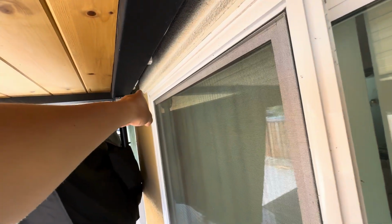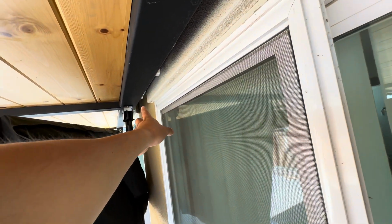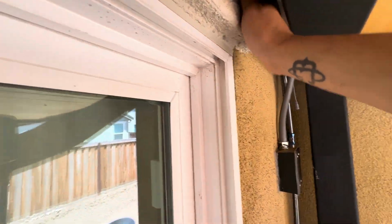So we're gonna go ahead and take it off again and do a 90 because it overlaps. So I'm just gonna do a back-to-back 90. Well, not really a back-to-back, it's just I'm gonna go to the very edge of the pipe, and whatever that gets me, it's a 5-inch 90. And after that, we're gonna go ahead and add straps on the pipe so it holds it in place.